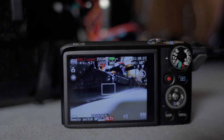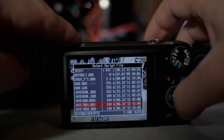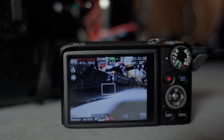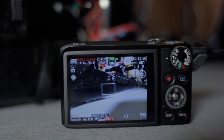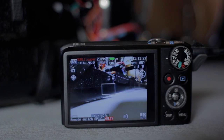This script running here has no delay built in, so it's taking pictures as fast as the camera can given the parameters that are set. If you needed faster, there are ways to write a more detailed script or change your settings to use burst mode. The scripts I have available are still faster than I need. Here I load the script with a five second delay to show the difference, and you can tell it takes five seconds between shots consistently.